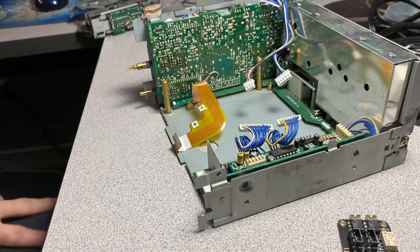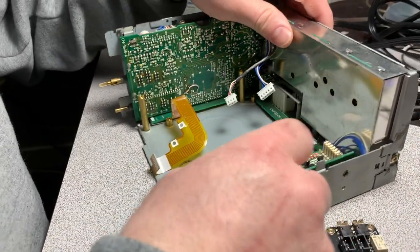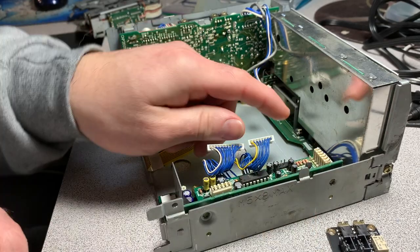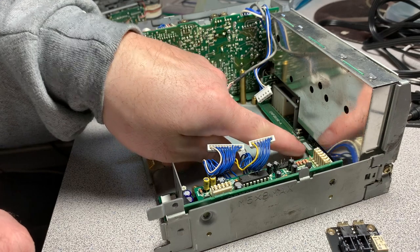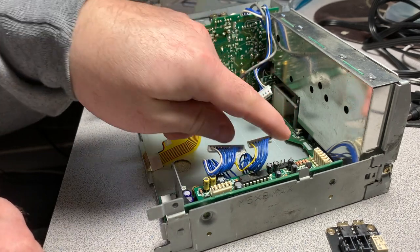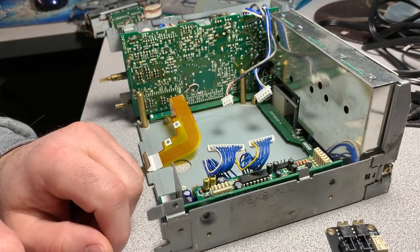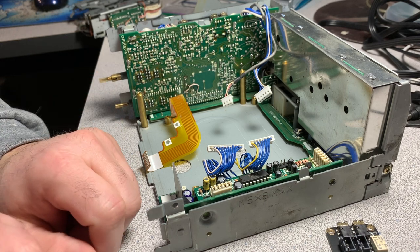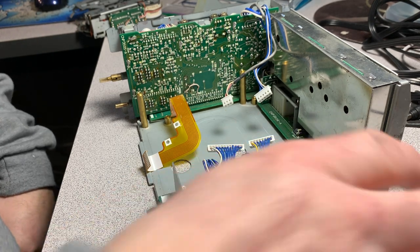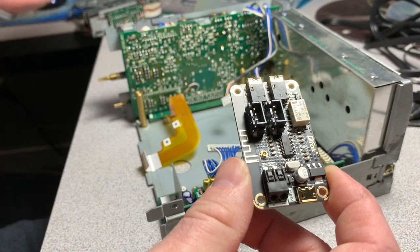But what if we intercepted the FM receiver instead? To do that, you have to identify where the FM receiver dumps its audio signal into the interconnect board - specifically what pins on the receiver's connections send the audio to the preamp or amplifier. I've already determined where those leads are. I still want the AM/FM function to work as well.